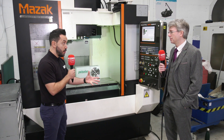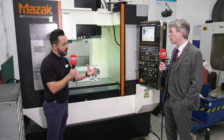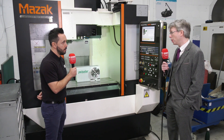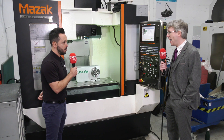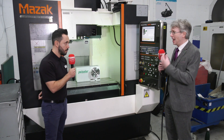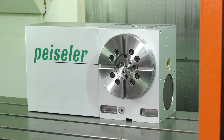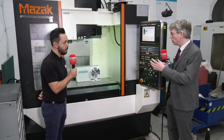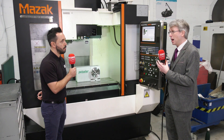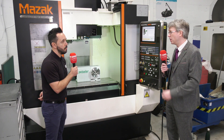Tell us about the rotary joint at the back and why you've got it there, and how easy it is to interface with the machine tool. On this unit we've got a 4-plus-1 — four hydraulic feeds and one air feed — which is an ideal solution especially for automatic fixtures: clamping, unclamping, and air sensing of parts. These are retrofittable, so if you've got a standard table and you want to add a rotary unit, we can do that. It also facilitates our style of fixturing — for example, if we're building a trunnion and want auto fixtures on top.